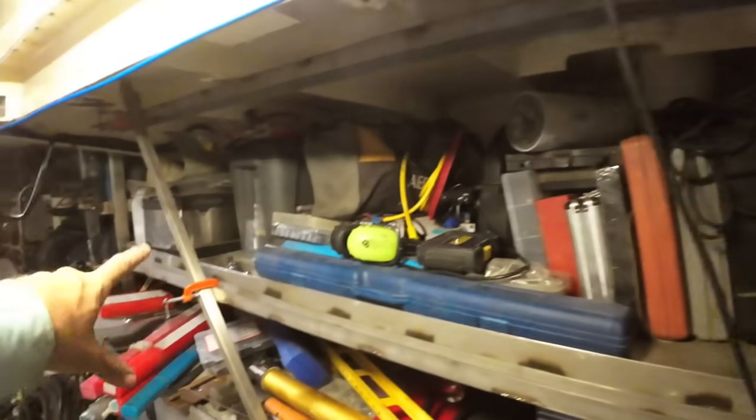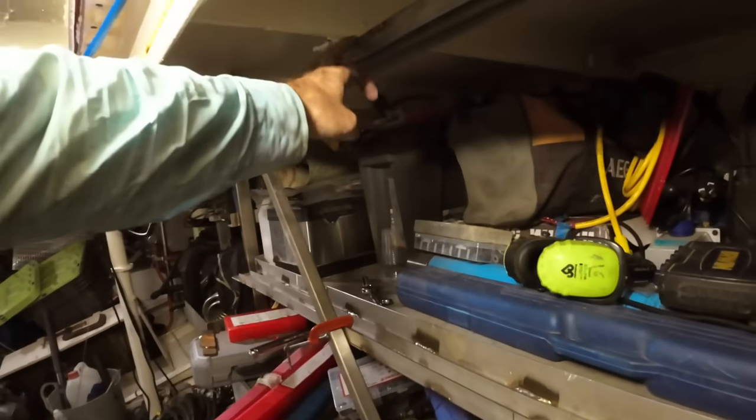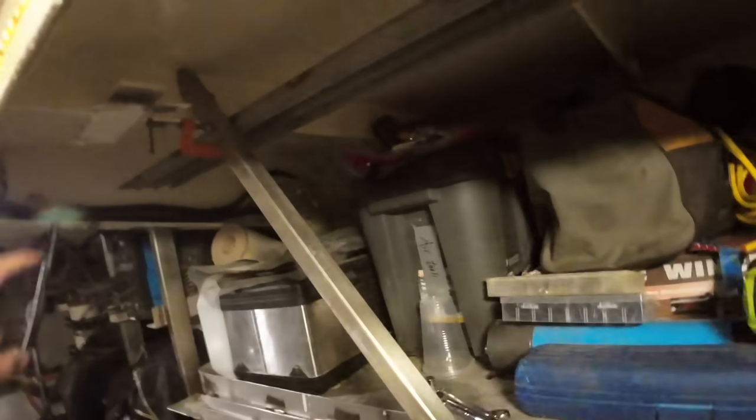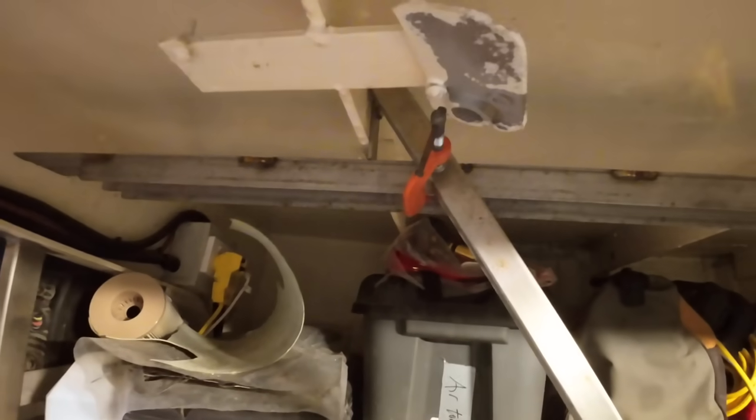Right, with it blocked up like that, clamped up like so, I know that it's parallel with the front face, so this face is parallel with this face, which is what I need. I have made these little tags, as you saw just before, and I've drilled one up here. It's a bit difficult to show, but sort of touch up there, bolt it in, you can sort of see it there. What I'm going to do now is weld it onto that end, and we know that end's fixed,